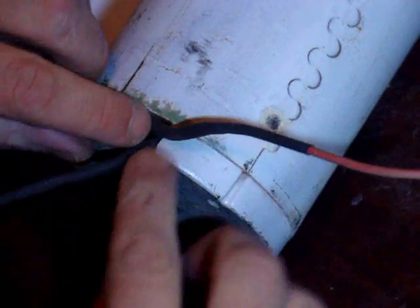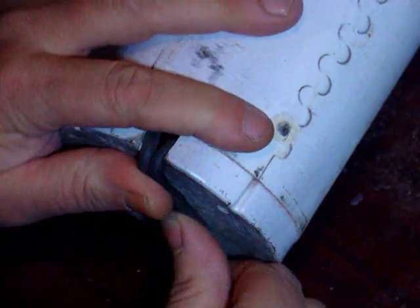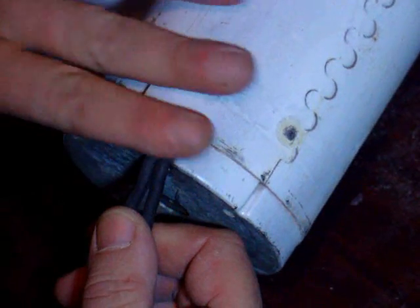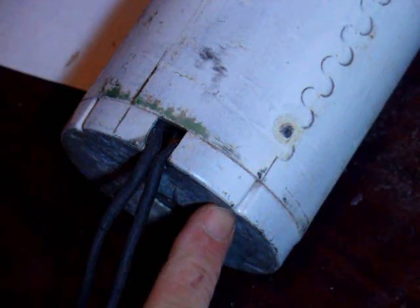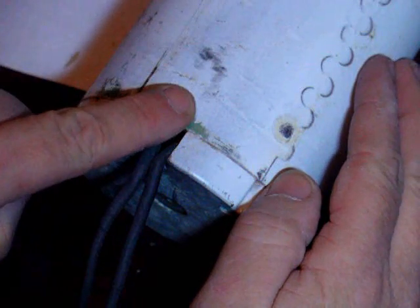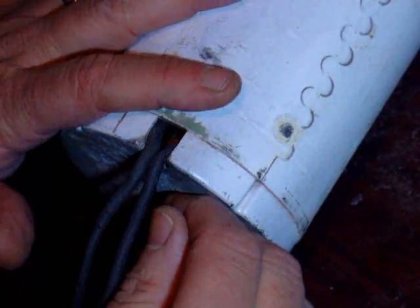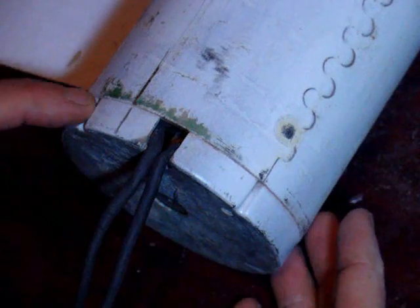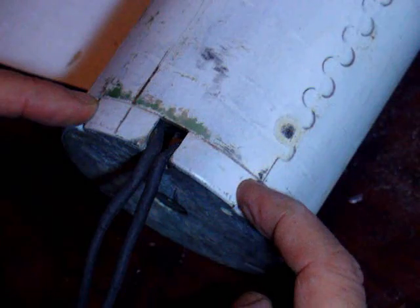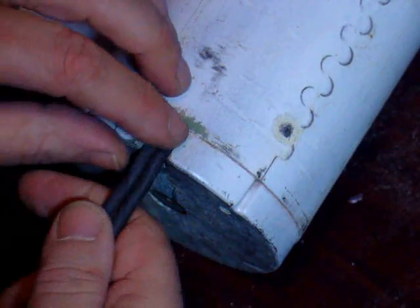I'm going to stick a piece of tape down in this hole, pull these over to the side, take that sharp edge off, then bend them back over here and tie-wrap them down like that. There's plenty of room between here and here so the PVC doesn't catch these wires again. They shouldn't get over the edge once I put the other screw here and the other one in here. Also, that piece of PVC has a slit that runs right down the bottom — that's probably how it got pushed over. I'll turn it a little bit, stick it in, stick the screw in here to lock it. I'll get one of those big hose clamps and stick it all the way around the PVC and tighten that up — that'll clamp it down even harder. We've got two notches here so I can put a screw in each one, and that should hold it down good especially with the clamp.